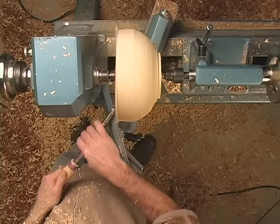And I drop the handle. Now I notice that there's a burning red spark right on top of the cutting edge. That tells me I've met the cutting edge. So what I like to do is hit the heel of the bevel on the grinding wheel first and then roll the cutting edge into the grinder.